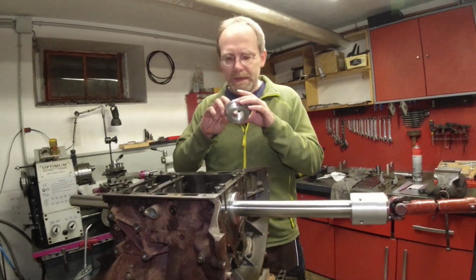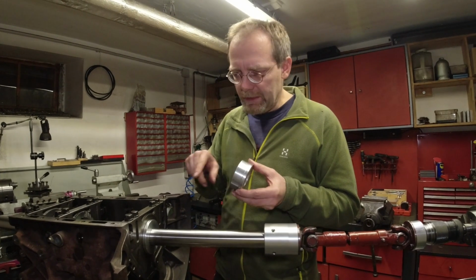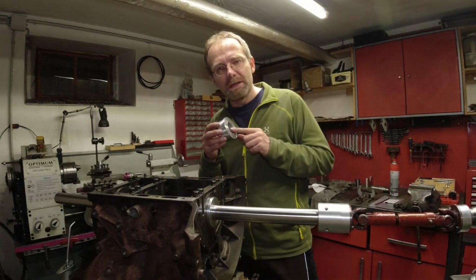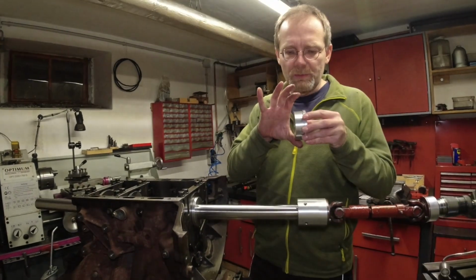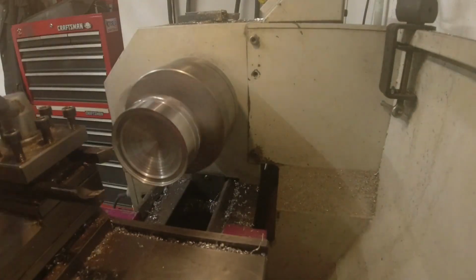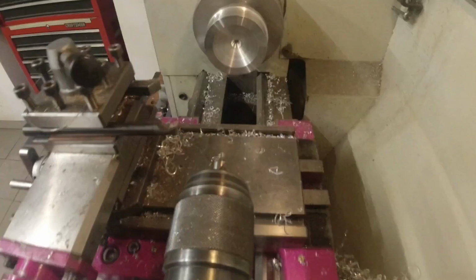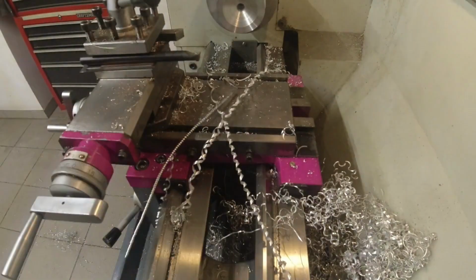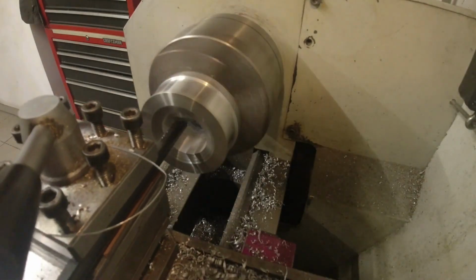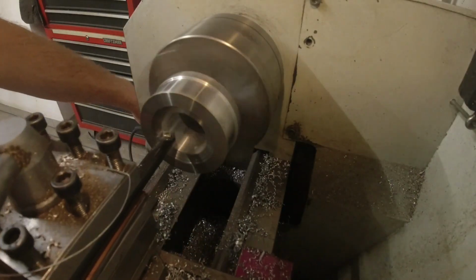Part 3 are the guide bushings. Now the guide bushings are also out of aluminum, and they need lubrication during the machining process. And the way these are machined, also very important, is to machine on my hobby lathe the OD and the ID in one chucking operation. You don't want to unchuck this. This way you can get them concentric, even on a poor machine like that, better than 1/100ths of a millimeter. Easy, not a problem at all. And of course you need to use sharp tools, and you use your experience to operate this thing.